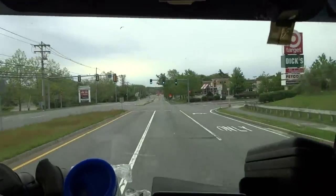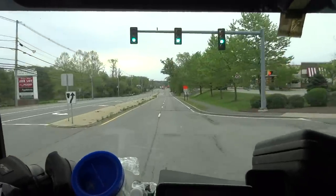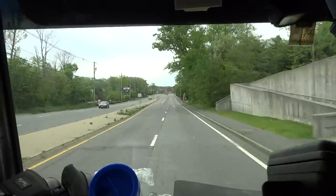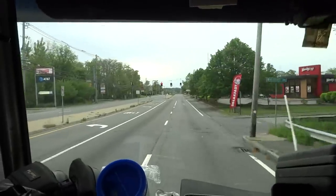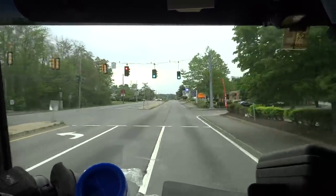There's no plywood up there, so we're gonna rip and tear that thing out and put some plywood down so I can move around up there without falling through the ceiling. The new air handler is 17 wide; the old one's 14, so I gotta do some modifications on the duct work.